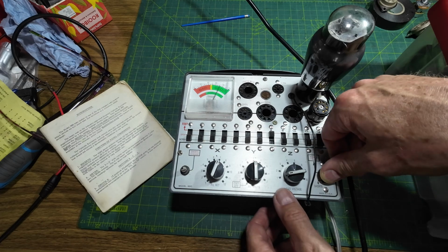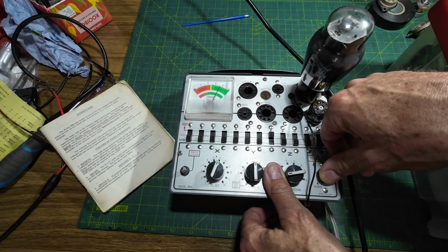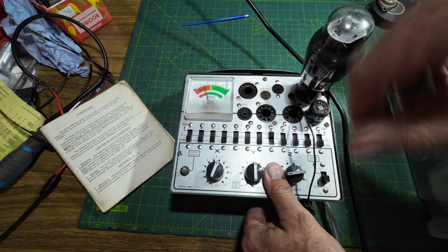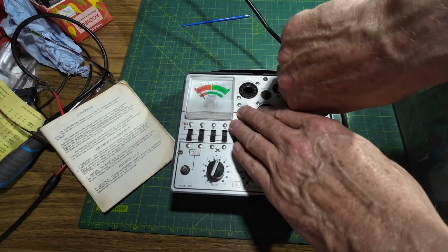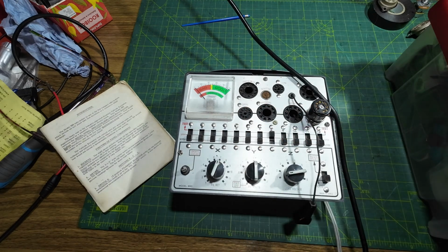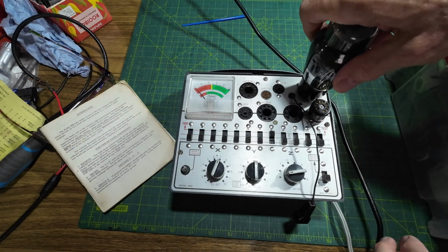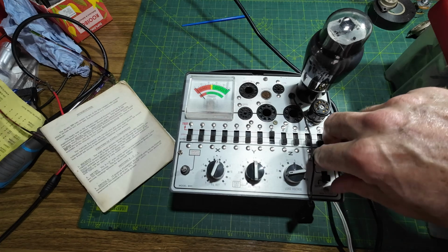Not brand new, but that's okay. That's 70 and climbing. So by the time that's warmed up, it's going to make 75 comfortable. So yeah, that's acceptable. Very good tube, that. Nothing wrong. But of course, internally, there may be problems with one of those 6L6s because it's been vibrating constantly with that very loose socket.